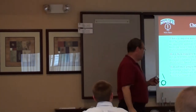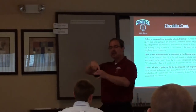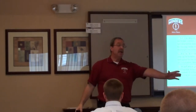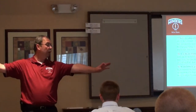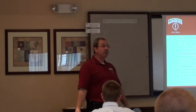Well, you can do the same on a diaphragm seal. They have very thin capillary, screws into the top of the seal, out to wherever the gauge is going to be. That's for remote mounting the gauge. So here, in your process, they put the seal on, and then out here, maybe we're going to bolt the gauge to the wall with 20 feet. You can do 30, 40, 50 feet of capillary.